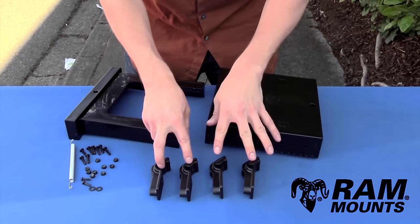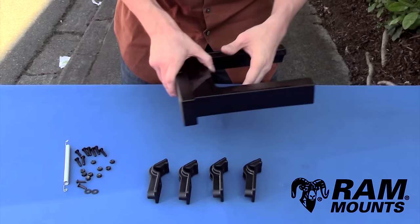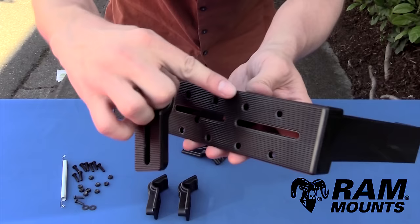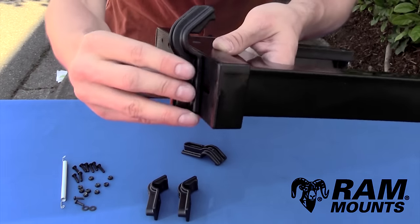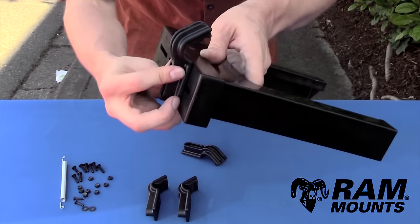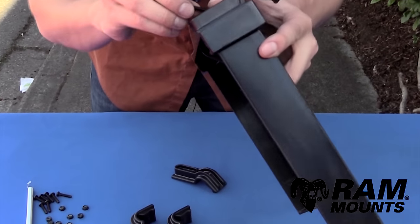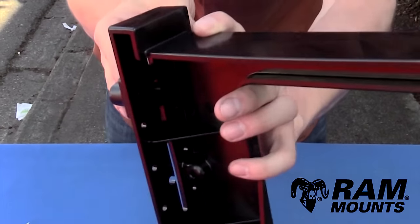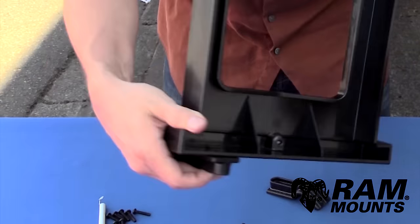The first thing you're going to do is attach four side keepers to the sides of the tray. Start with the slide portion — take two of the side keepers and position them along the ridges on the slide. You can see the same ridges on the side keeper, allowing you to position up and down and slide side to side. Take one of your number 10 screws and insert through the side so it protrudes on the inside of the slide.